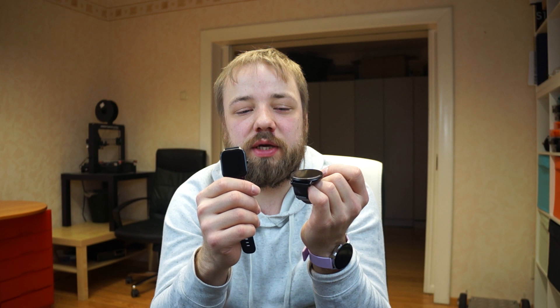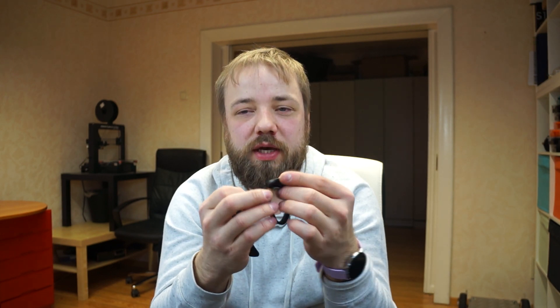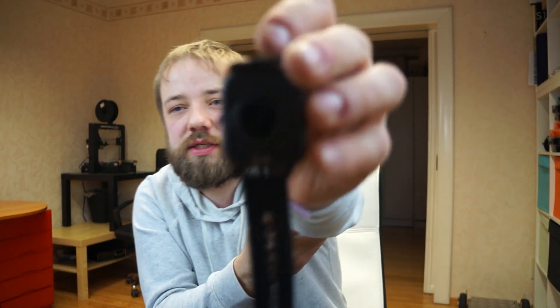What's also quite nice is that the pinout of these watches is the same between each other, and it's also the same as the PineTime, since this one also uses the DaFit app. The DaFit producer has about 100 different NRF52 watches with the exact same pinout for the display and the I2C devices — the heart rate sensor on the back, the acceleration sensor — and the touchscreen is the same as in the PineTime.